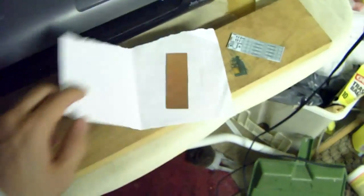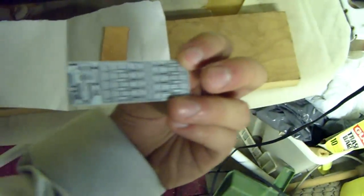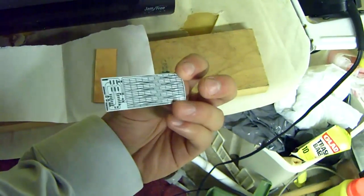When I transfer the toner, it's usually best, at least I've found, to place it in a paper leaflet thing. That's to help protect it from any kind of initial thermal shock and to help distribute the weight. I can either use foil to laminate this design first, or in my case, since I used extra heavy ink, I can just simply lay it straight on. Be sure that you do not have any of the toner over top of an area that is not covered in copper. Once this is nicely packed away in this little sleeve, you can peek to make sure everything's fine.